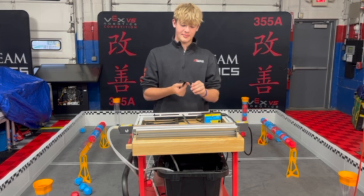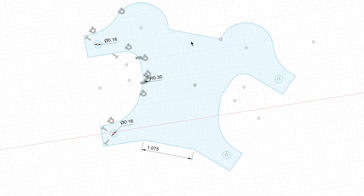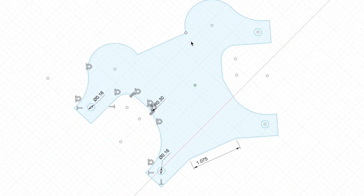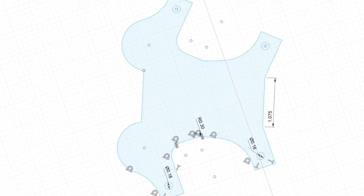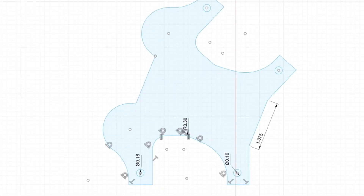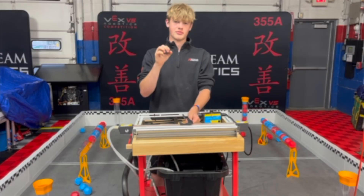then the perfect distance between here and here for that rectangle in between on your CAD is going to be right about 1.075 inches. 1.075 inches is just enough — so if you bend it from corner to corner on your design, it'll fit over that C channel really smooth.